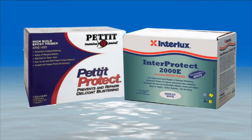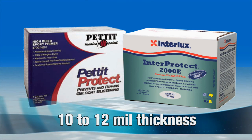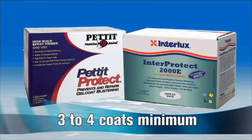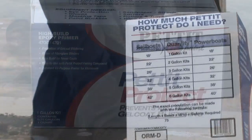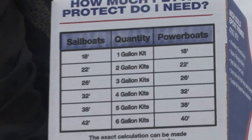Both Interlux and Petit barrier coat products require a minimum of 10 to 12 mil thickness, and you can expect about 2.5 mils per coat from Interprotect and about 4 mils per coat from Petit Protect. Do the math, and that means 3 to 4 coats minimum to do the job right, depending on the product you select. Calculate the per coat requirements by looking at the theoretical coverage indicated on the product.